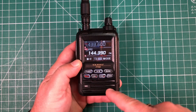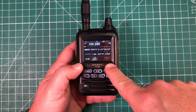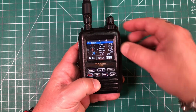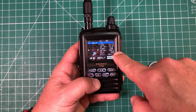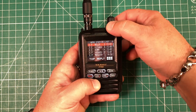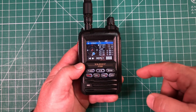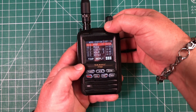Since we've received and transmitted packets during the drive, there's data stored in the radio. Make sure the GPS is on to see more data, then short press the F menu button and make sure you're on the second page — you'll know by the back button. Hit S.list to see all the times, stations, and packet info received today. Clicking on an entry shows GPS coordinates, distance, power, and antenna height. One station is 26 miles away, transmitting at 25 watts with an antenna at 160 feet omnidirectional, located in Conroe, Texas.